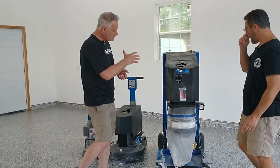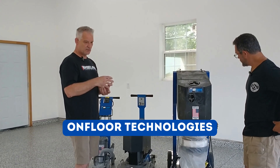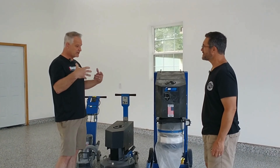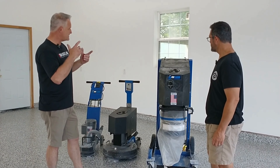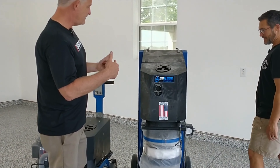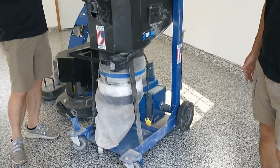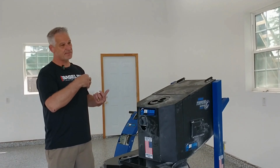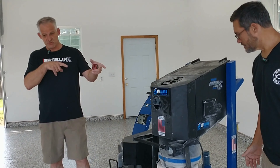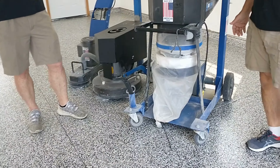I work for OnFloor Technologies, and my crew does this as a side gig. We participate with OnFloor by testing units, R&D projects, and testing diamonds on the floor. This particular unit is new for OnFloor — it's a cyclone pulse vacuum system. With the cyclones, it takes the incoming dust, separates it, and the main filter only sees 5% of that dust. That's what provided what you saw on this job — we didn't have to mess with the vacuum, clean it, or clean filters.